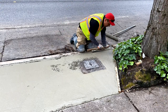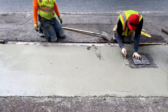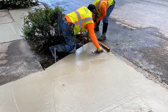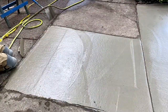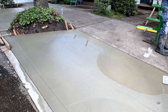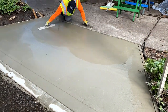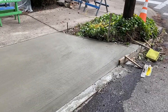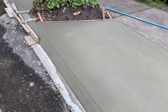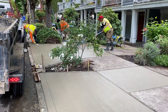He's just smoothing out the concrete, making it really nice in those areas. Any low spots we notice, we just bring concrete over and fill them in — those are the wings. Then with our Fresno tool, we smooth it out even more, just getting the edges nice. At this point, we're pretty much ready to do the broom finish. We ran the broom across this first apron and also this second apron with the sidewalk area.